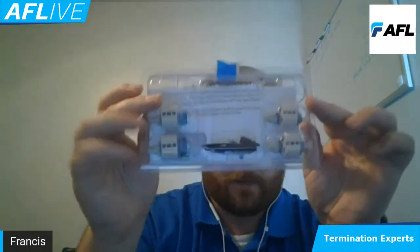So next, we look at our mechanical connection. This is going to be an LC format that we call a fast connector. As I showed in the Termination Expert Guide, this is mechanical driven. The only tool that we would need with this is a fiber optic cleaver. So I would come in and prep my fiber optic cable. This is going to be an OM3 cable. I would use a form of hand stripper to clear my jacket, clean that component, and then put it in a precision cleaver. And then I would take the connector out of a small package like this, which comes in a pack of 6 or a pack of 100, and then terminate it.